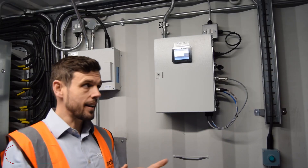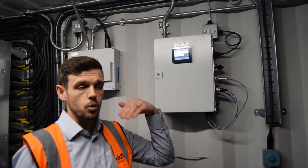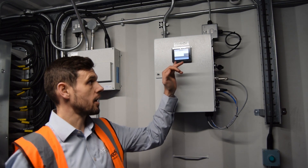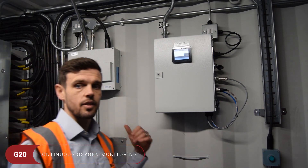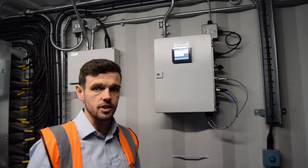Part of this package is an oxygen sensor which provides a continuous readout inside the secondary chamber once it is above 600 degrees C. The readout gives both the temperature and the oxygen level. This data is transferred to the PLC so you always have a constant reading of the temperature and oxygen levels through the main controls.